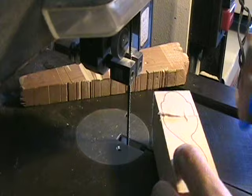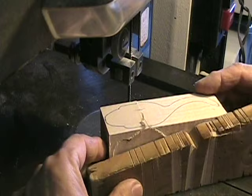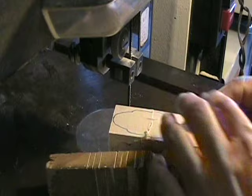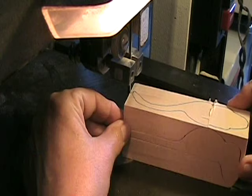One of the things you're going to see me do too — when I feel that I'm getting anywhere close to any kind of danger — I'm going to put this block here. By putting it here, it holds the blank together, and I'm securing it at both ends while cutting in the middle. When I've got this block to support it, I can go ahead and cut on the line. It's not going to be like coming through without support — just think about it: if it comes out of the wood with nothing holding it, that would not be a good thing.